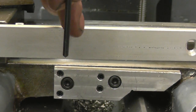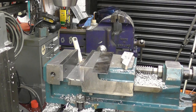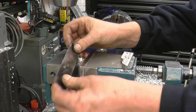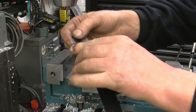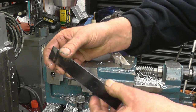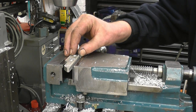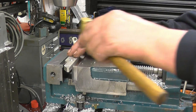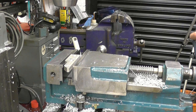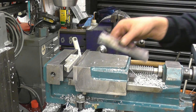I've marked through the transfer punch — there's one there and one there — I want them drilling and tapping 4mm. A friendly man gave me some of this steel banding, which they use for fastening things into crates. It's the same width all the way down so they make good thin parallels. I'm going to pick those two holes up, drill and tap them 4mm.